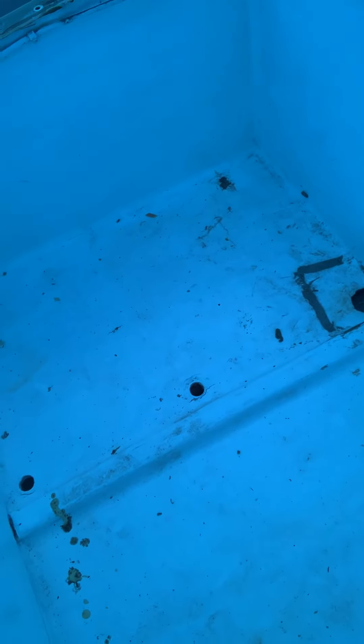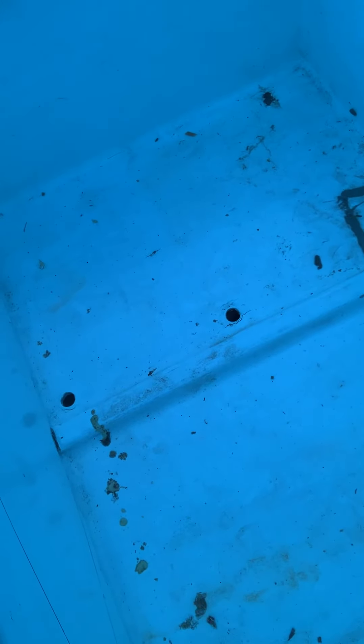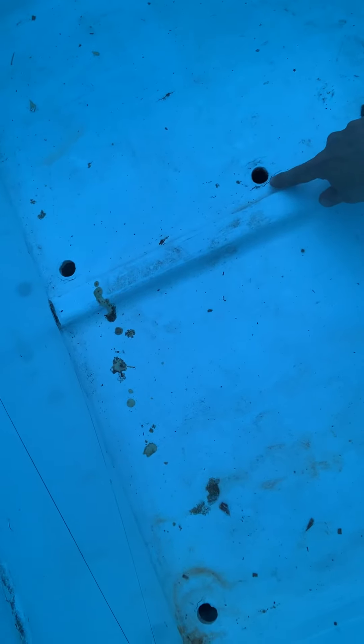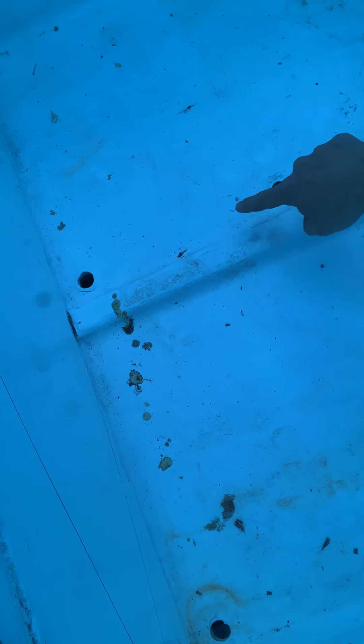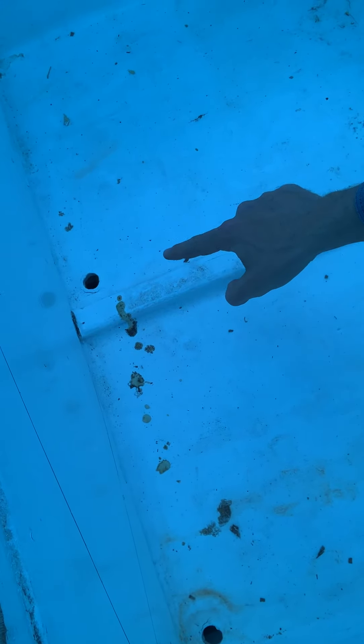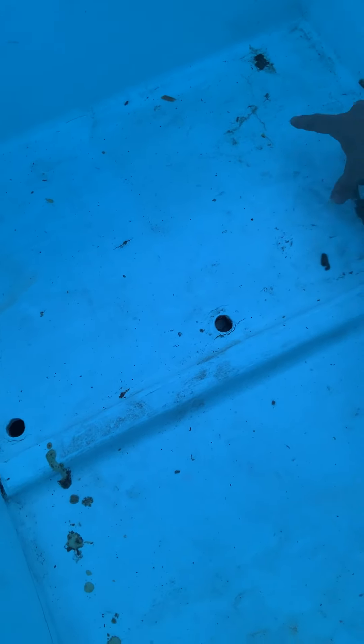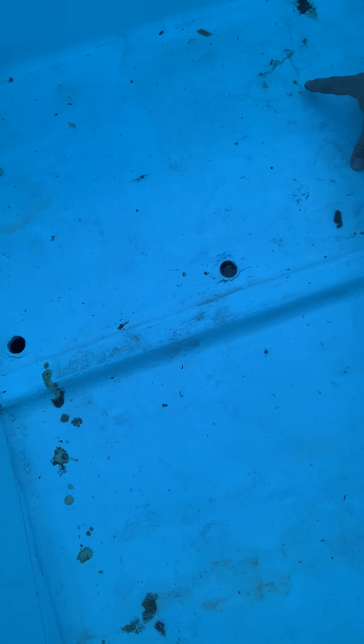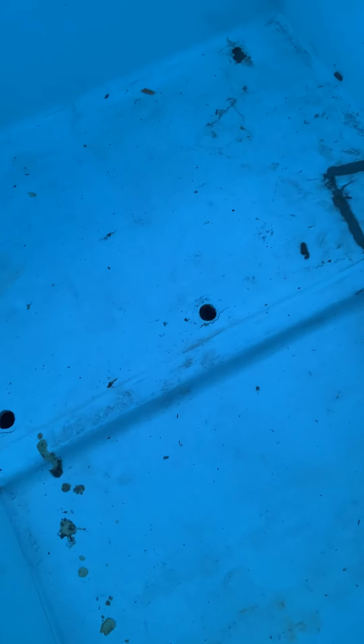These lower fairings have not been properly sealed, and the drain tubes — again PVC — more things done wrong. You can see that moisture came into the plywood and caused the surface coating of epoxy, which was grossly inadequate, to crack. Moisture also traveled throughout the plywood causing it to expand, and cracks formed here as well. This drain was very, very poorly bedded.